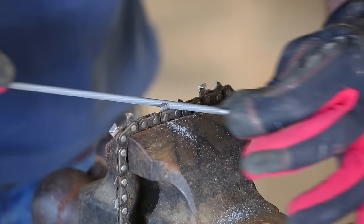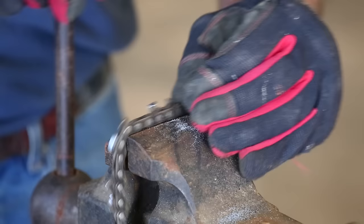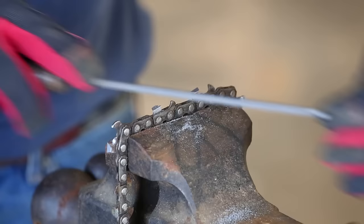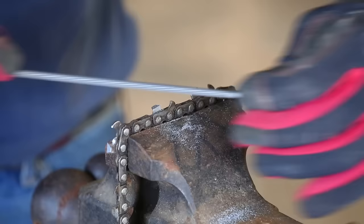There are only a few strokes. I don't keep track of the number of strokes because I'm trying to do it visually — the length of the tooth, the shape of the tooth, filing away the damage, all those things at the same time. It's a matter of using some discretion as you file here. You have to think it over, have your points made in your mind, and then just do it when you go to file it.